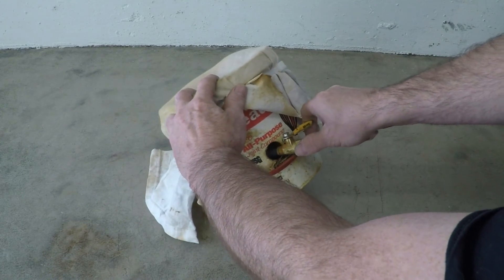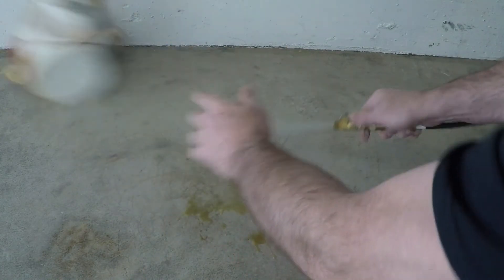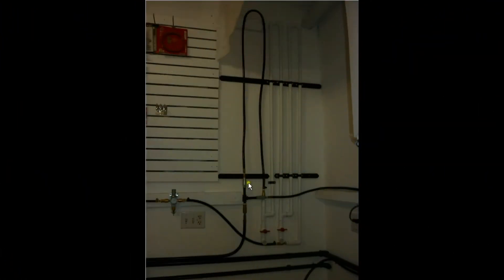However, since you're shooting about 100 psi into this bucket, make sure you hang onto it. The air continues to cool as it travels along this hose, and at the bottom of each of these runs, I place a valve to drain any water off.